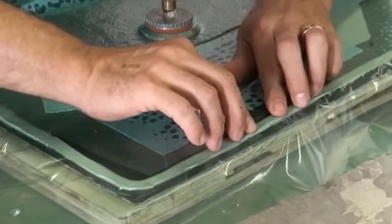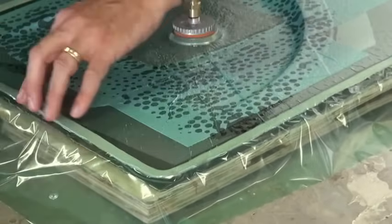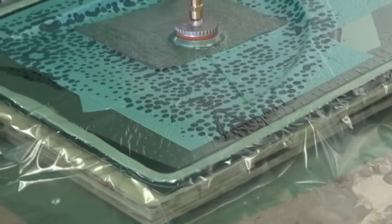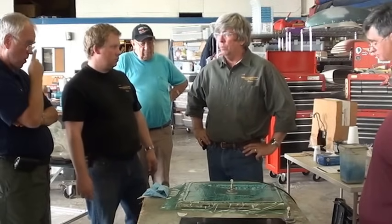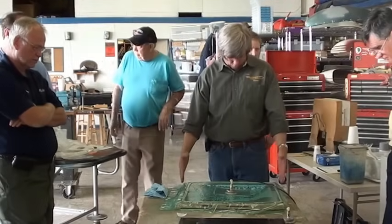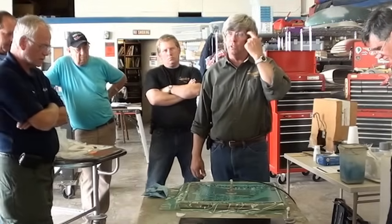It's 17 to 19. It's just a matter of finding these spots that are leaking and stretching them out until the leak goes away. But we'll be able to get probably 25 inches out of that pump pretty easily, which means we're getting at least 12 psi. So if we round that to 10 psi that we're working with, and even if we're only, let's say, 15 by 15, what's that in square inches?